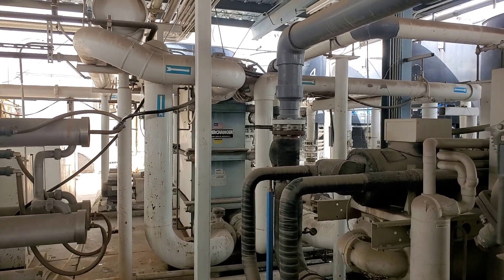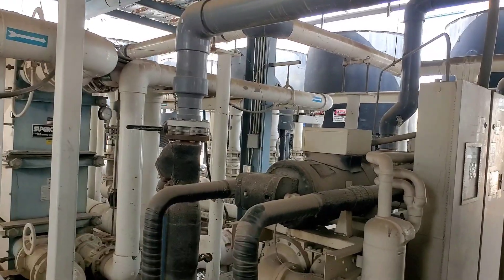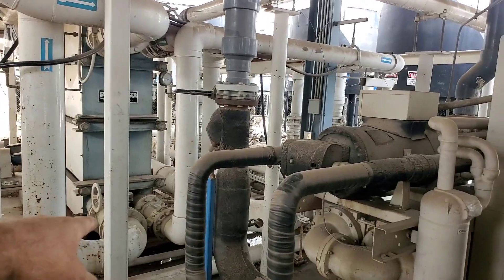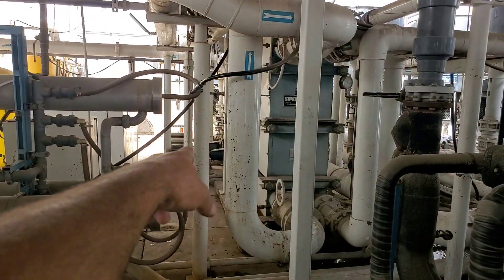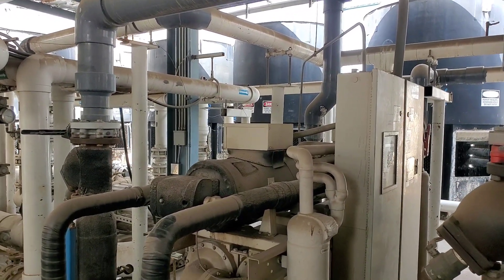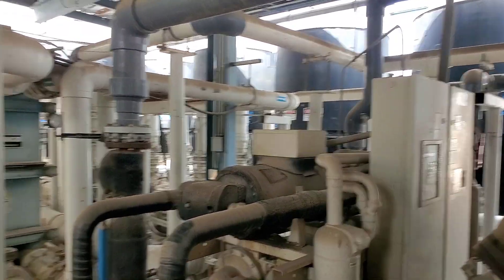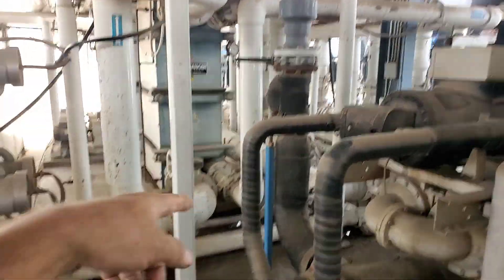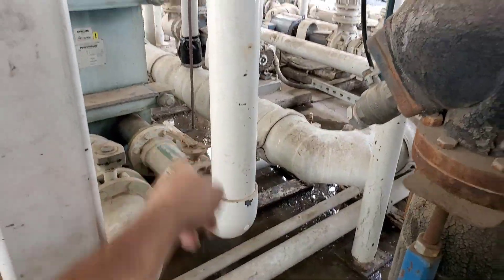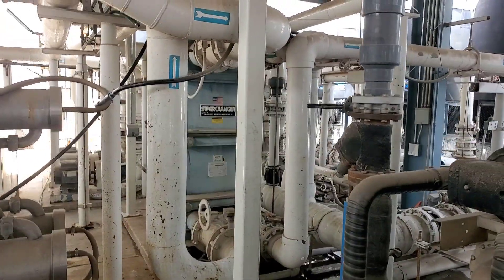We gotta get them some repairs. I say they should put in a couple of new cooling towers — you'd get new spray pumps, get rid of the two pumps over here for the spray, and then you just need the building closed-loop pump to push through the tube bundle. With new cooling towers you have built-in strainers on the spray pumps, so you don't have to worry about adding them over here. Right now it doesn't have a strainer here, and that's all open cooling tower water going right into this heat exchanger. Those could be cleaned out but I'd probably break all the gaskets.